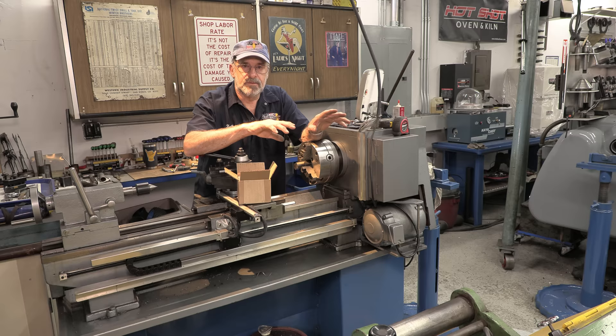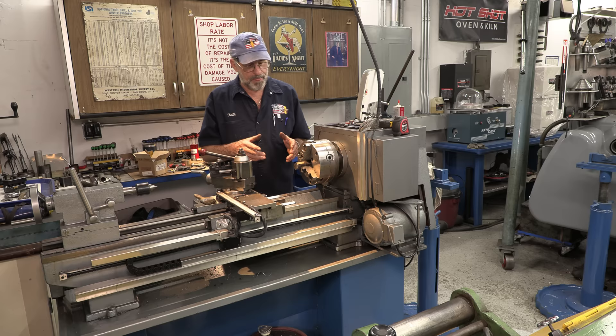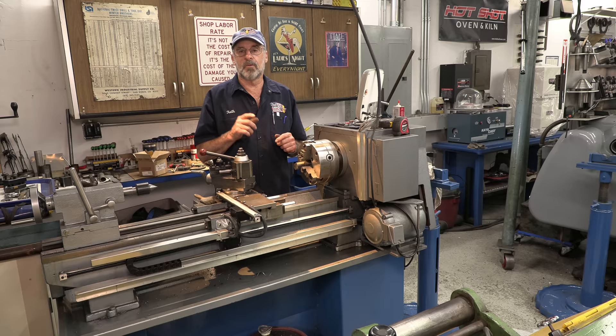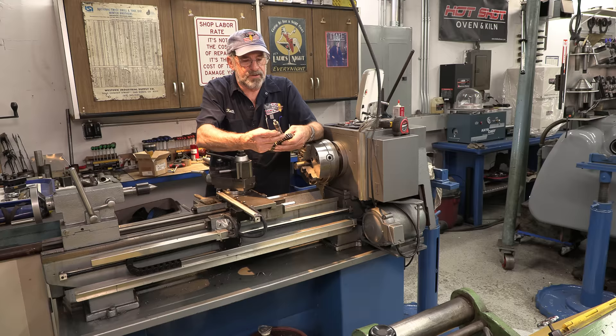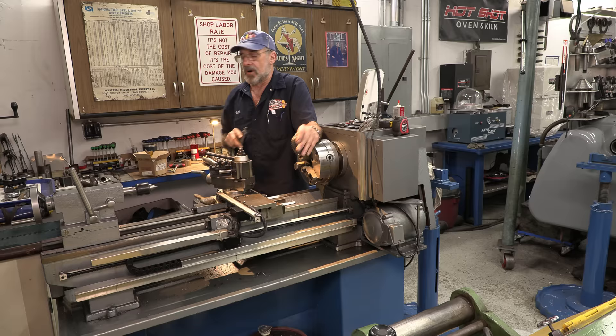We're going to get into the grinding after we get the gear set up in the lathe. We're going to mount the soft jaws. I know basically this diameter for the gear is 3.400 on the outside. I happen to have a readout on this lathe, and after having the readout I know I want to put one on the Monarch too. I'm looking more towards the DRO pros — putting one of their sets on there and sponsoring the veterans that run that as well.